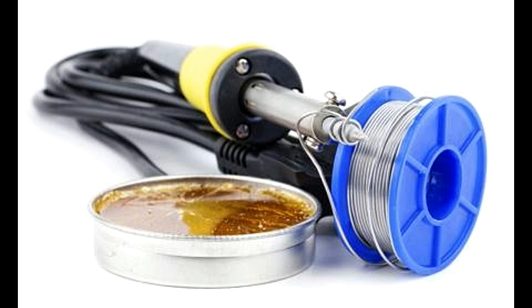The flux is designed to melt below solder temperatures. This allows it to spread over the surface and perform the fluxing action, removing oxides and getting rid of them prior to the actual soldering process. If the tip of the soldering gun is allowed to remain on the surface where the flux is applied, the flux first liquefies and then quickly evaporates. It is therefore important that the soldering should take place immediately after the flux melts, and before it can evaporate.